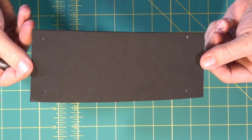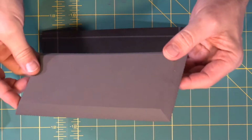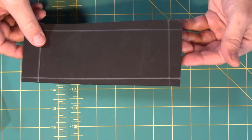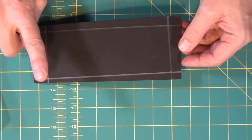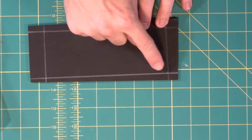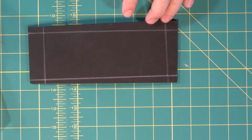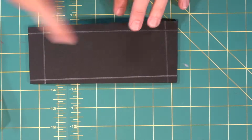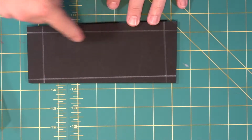We marked our corners out the same way we did on the base. We did the bevel cut. We're gonna do a bevel cut also around this, so they each have a bevel. It's a nice detail, but before we do the cut, we wanna measure out and draw all of our lines, because we're going to be coming in with our wood burner, and we're going to be burning a series of grooves for a nice detail through our base plate.